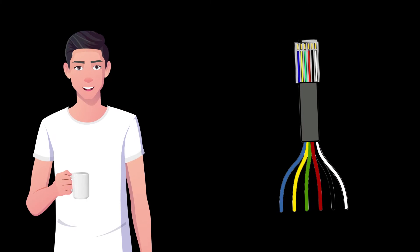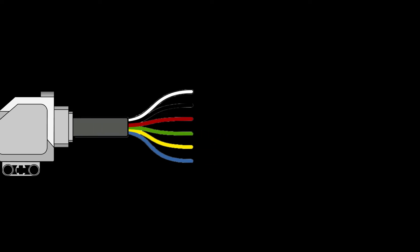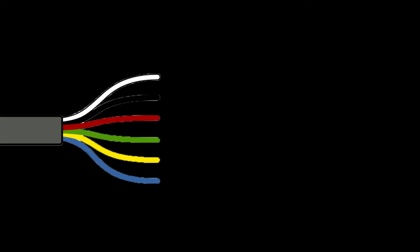We need a special cable, which you can find in the video description, in order to connect the motor to Arduino. Plug one end to the motor and on the other end we can see 6 dupont terminations. Looking at the datasheet, the white and black cables are used to drive the motors — I've already explained that in my previous video. The red cable, unlike what you would imagine, is the ground connection. The green is the VCC. Blue and yellow are the output signals for each beam. We connect the ground to the red cable and 5 volts to the green one.